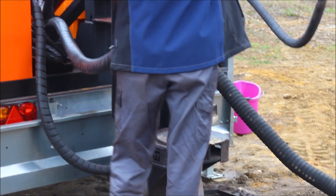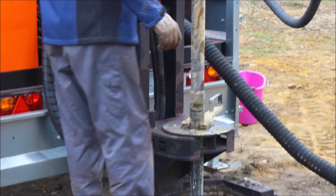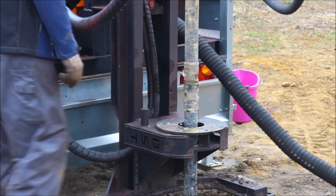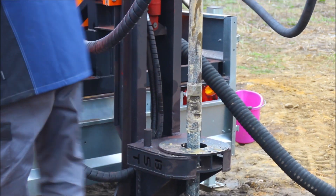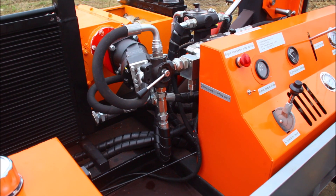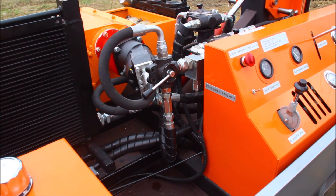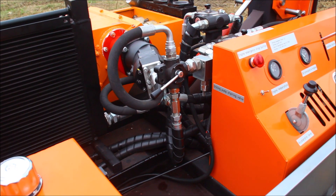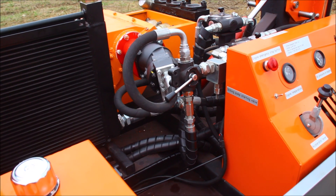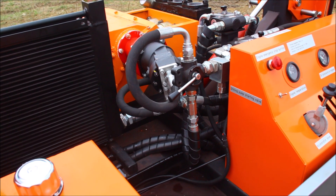In order to add the second drilling rod, you use the universal drilling wrench. You put it on the professional drilling table, rotate the drilling wrench and add the second drilling pipe. When you add an additional drilling pipe, you need to switch off the pump using the drilling pump start valve in order to stop the supply of water from the water pit. Otherwise, the water will be splashed out from the drilling rig.